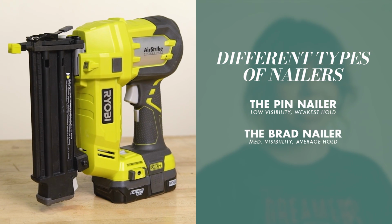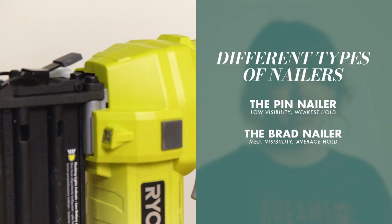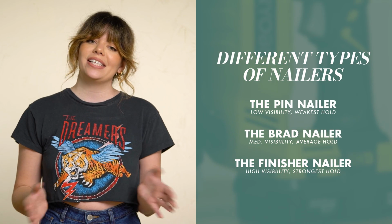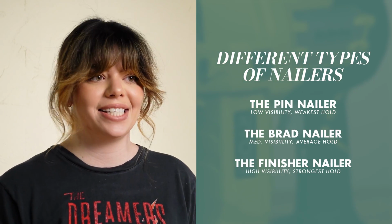The brad nailer, which takes 18 gauge nails, we used this today. It has a medium hold and a medium visibility. And the finish nailer, this takes 16 gauge nails. It has the strongest hold, but is the easiest nail to see.